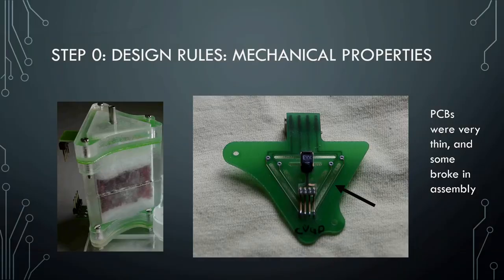There are also mechanical properties to consider. PCBs come in different thicknesses. In the case of my PhD PCB, I needed a very, very thin PCB because I had very tight restrictions on this component, and all of these measurements are minimized as much as possible for clearance, manufacturability, and stability. This PCB was really stable once it was in the column. But a number of my collaborators — because this was delivered all over the European Union — were not very careful, and they would bend it or break it, which made my fab even more happy with me because they kept having to rebuild them. You need to think about manufacturability and how strong it will be once you start removing the inside — will I be able to bend it like paper? Because if you can, it's not going to last very long.